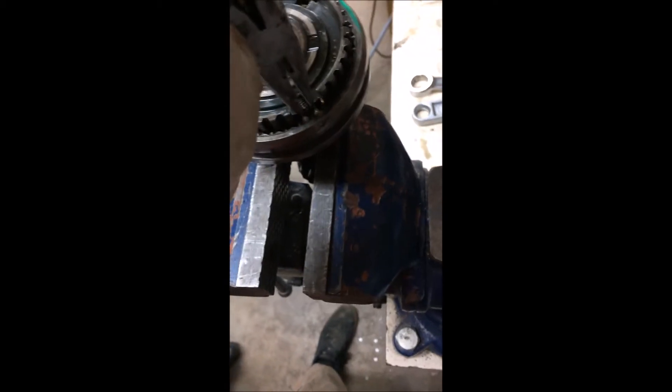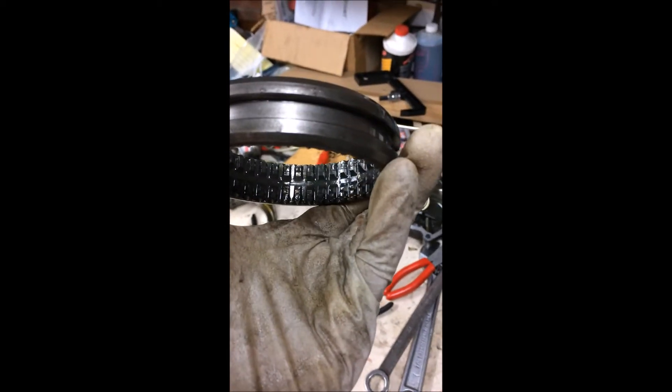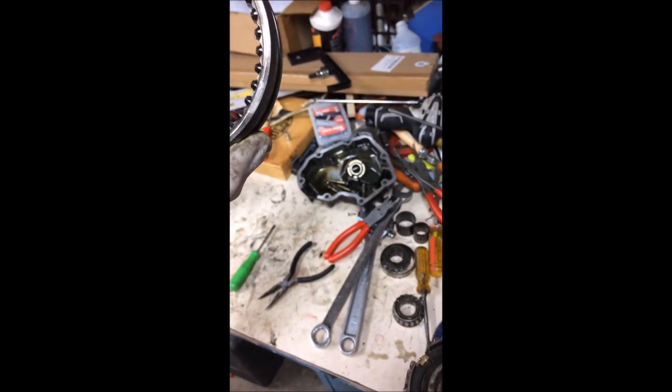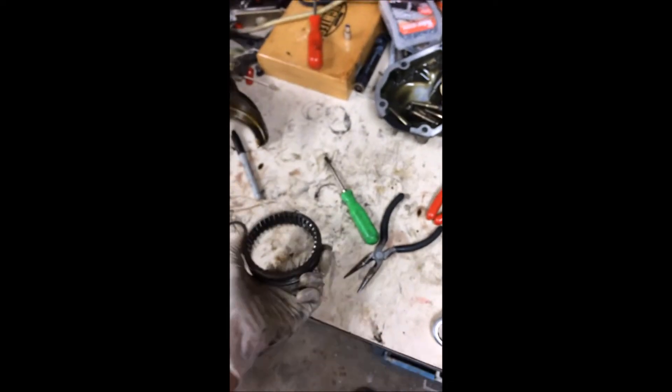There's a spring and plunger in here. I took the other two out - I'll use some needle nose to pull them out. The spring goes in first, then the plunger, and then these little cylindrical-looking things. Next you can go ahead and take this engagement ring off. I like to put this on the same way I took it off. You can also see a way to remember that - there are manufacturing marks on the bottom, it's flat completely, and on the top it is not like that. The instructions don't say this goes on a certain way, but it's best to put it back on how it was wearing. This one's going to be easy because there's green paint on it already.